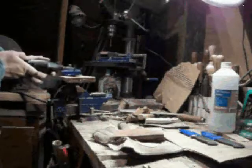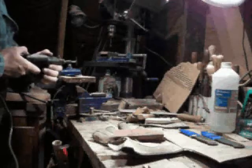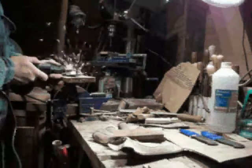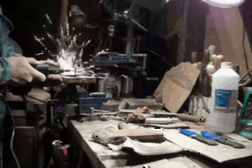I'm going to put on my safety glasses. If I can do this without knocking the camera down. I'm going to take a Dremel tool, and I'm just going to scar the tang so that the glue, the epoxy, will bite into it real good. Let me just show you. You can see that or not. I want them all running this way.